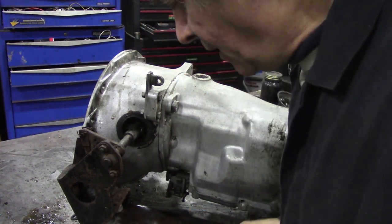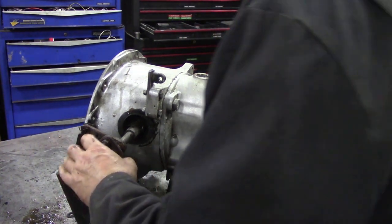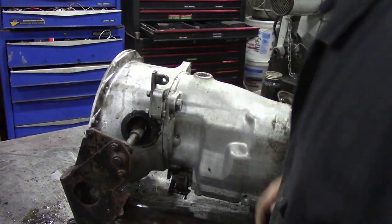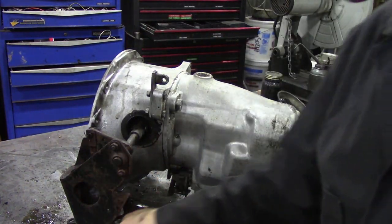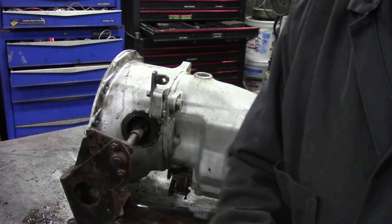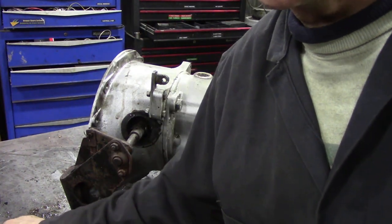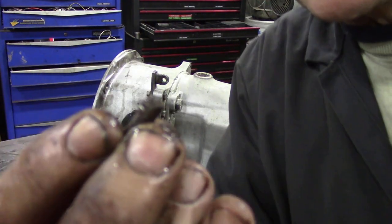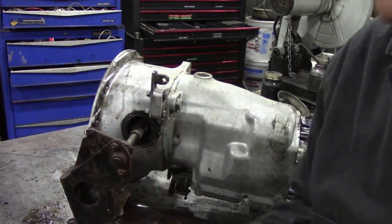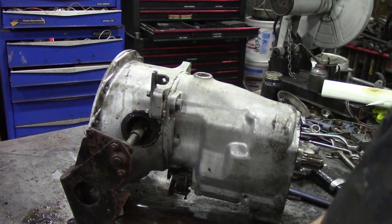There's the pin - it is a bit warm. Heat always nice, it just expands it that much. So there's the pin that came out. That's all that was driving the clutch because there was half of it missing. I'll show you a good one when it comes out. So now we get some spray - you can see it boiling now. We get a hammer and we're going to try and tap this fork out of here.